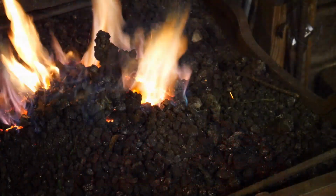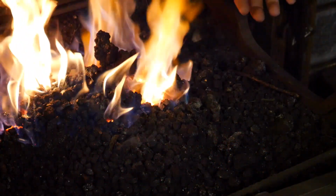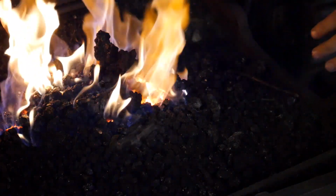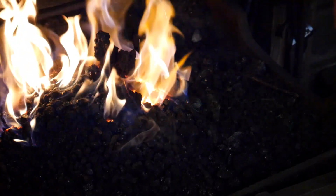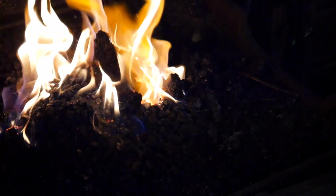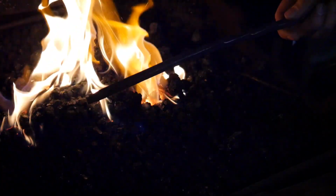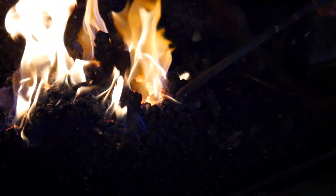So today I'm going to be talking about brass brushing steel. Okay everybody, so the first trick, I guess it's not really a trick. Everybody's seen this before, or a lot of people have. The first thing I'm going to do is forge out a small leaf. This leaf doesn't have to be made out of anything particular. It can be made out of any piece of bar stock you like. In this case, I'm just going to use a piece of 3/8 inch square bar or 9 mil square.